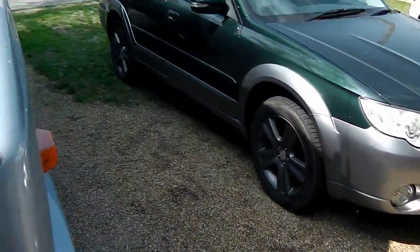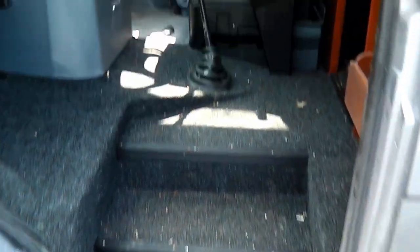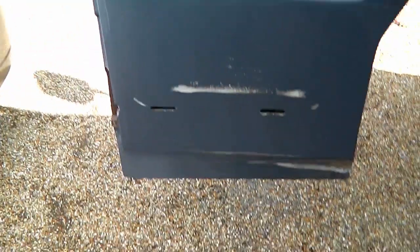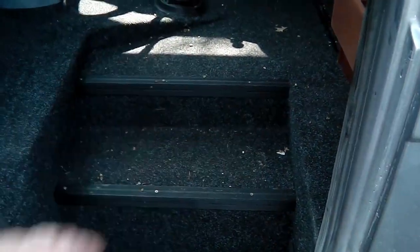Previously it was a bus. What we're looking at in this video is how to put a seat here. A lot of these Varios - I've seen some people convert them very nicely - they put a seat kind of where the bulkhead is, so the seat sits back a bit so you can get in and out via the steps. These were modified when they built them - there's like a big fiberglass tub that goes around this area, and the door itself gets extended with a piece of fiberglass and it's built up at the bottom. We're going to remove all that, take this tub out, and put a seat up here because Mrs. Bob wants to sit next to me when I'm driving.